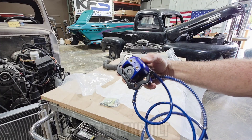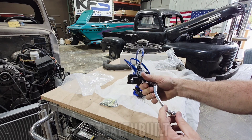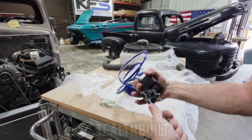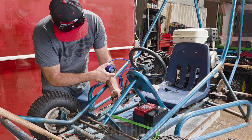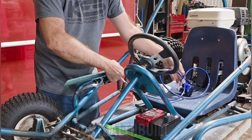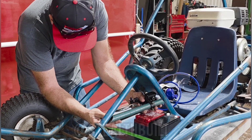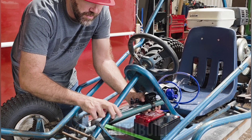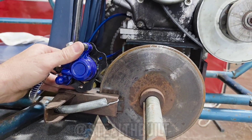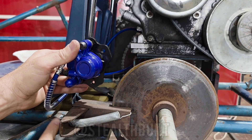Look at this caliper — it's not bad, hydraulic lever. I'm thinking we mount it up there and maybe drill a hole so this has plenty of leverage to pull. I've got a piece of tube mounted to a lever: the thought is the caliper goes to the back and the brake lever on the tube will mount under here. We'll weld it onto the frame right here and then that servo can mount between here and just pull that brake lever. I'm going to make a bracket that mounts to these two holes, weld it solid, and cut this arm off.